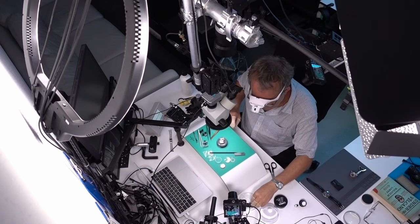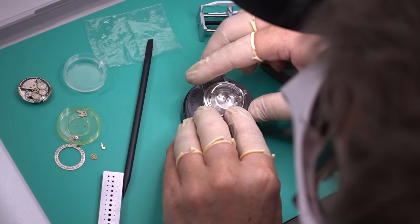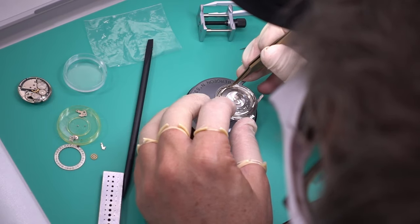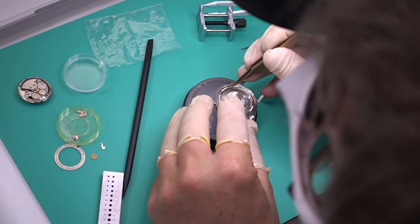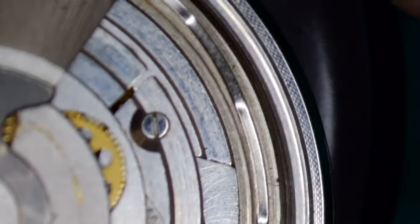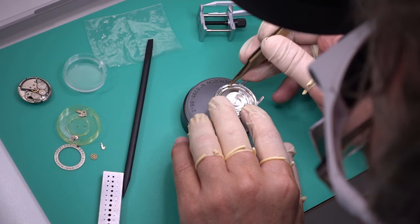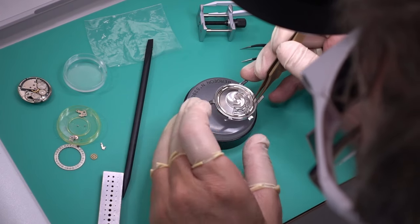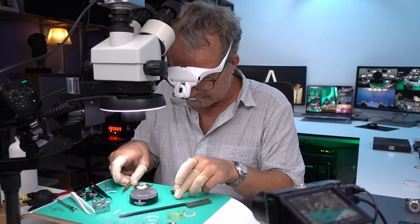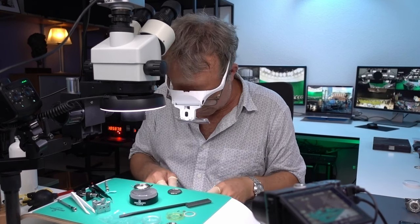So then this spring holds the movement in the case so that it doesn't rattle around. This watch came without this spring, but I took it from spare parts. I had to alter it a little bit to fit, but because it's a spring, it was fine with that. It springs out to the correct position. Technically, I should grease this gasket, or it has a chance of binding.